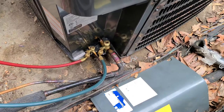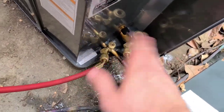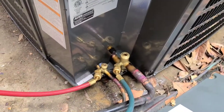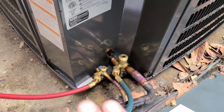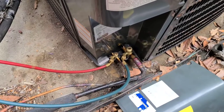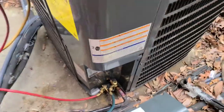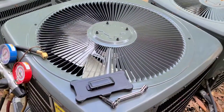Make sure you put your Schrader valves in before you vacuum or you'll have to redo it — I've done that a couple times when I first started and it's a pain. Just make sure you did it. Once you have your refrigerants and everything open, you do your startup, check your pressures, check your charge, and do your temperature split. That should be it — you've got a new AC condenser changed out. Thank you for watching.